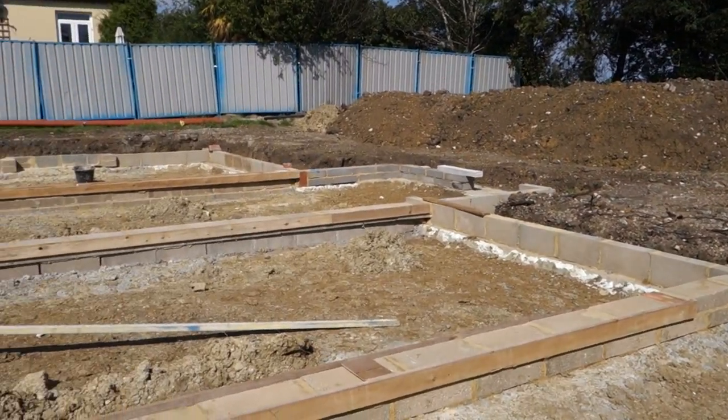But the short task, just for the second, is we've got to fill these up with concrete. And what I'm using is sharp sand and pea shingle, because it's a shallow filling. Pea shingle is stone, so that's going to give us good compression capability, but making it relatively easy to lay. So without further ado, let's go across to the cement mixer. You've probably seen cement mixing 100 times before. We're going to put one of cement, two of sand, and two of pea shingle, and then we're going to lay them in the troughs, and you can see me do all that in a minute.